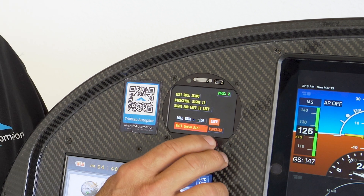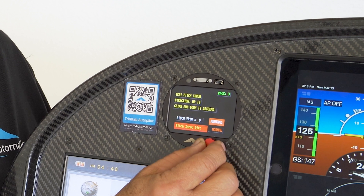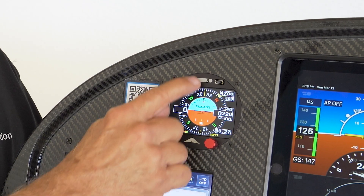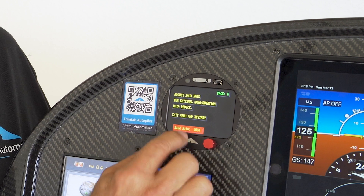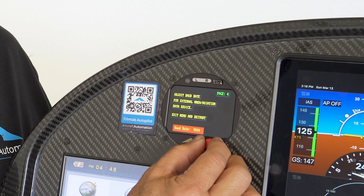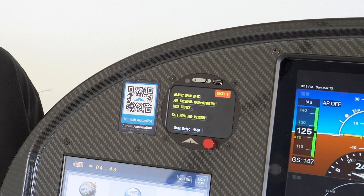This is the roll servo. You will do the same with the pitch servo — make sure up is up, down is down. If not, go here and change it to reversed. Finally, on the first phase of the autopilot calibration on the ground, we press the L key, we go to page four and we can adjust the baud rate. You have to synchronize the baud rate from your GPS to the SuperEcho baud rate. So we click on here and we choose the baud rate at the bottom. 9600 is a typical baud rate that most GPS units use. So that's all we need on the ground.